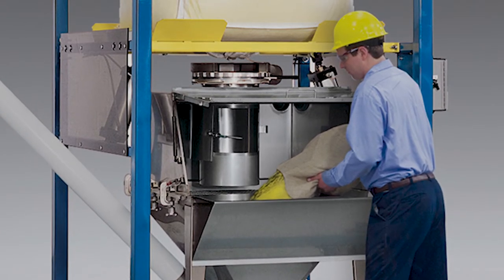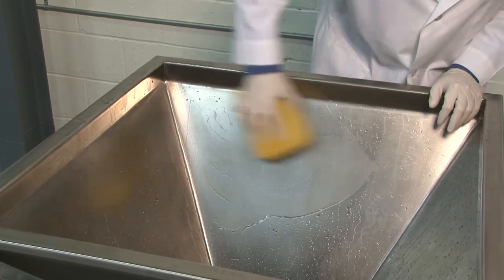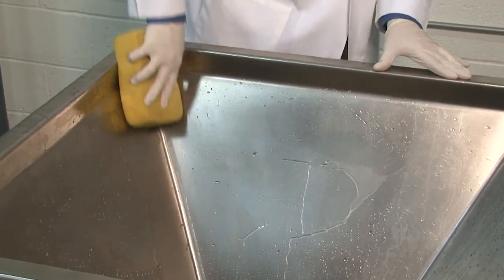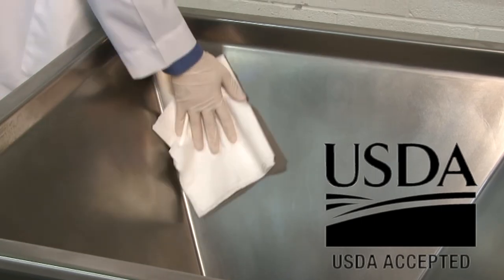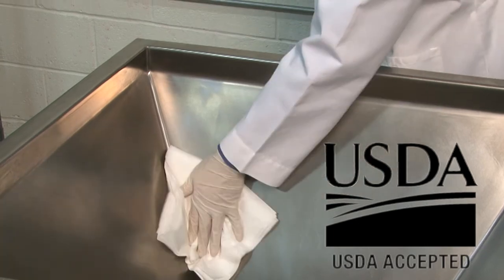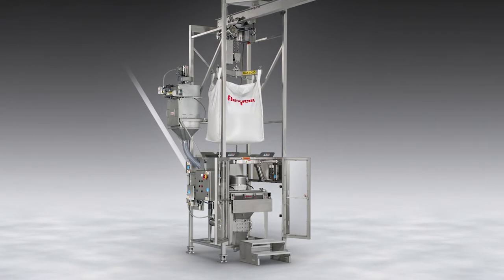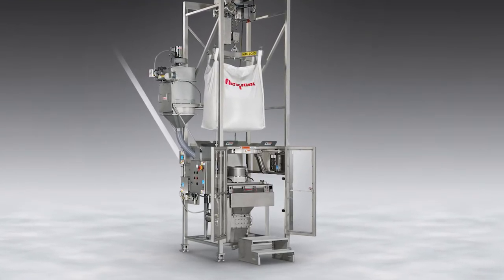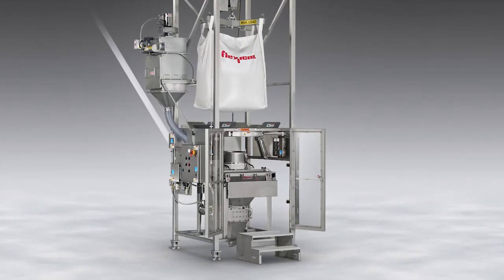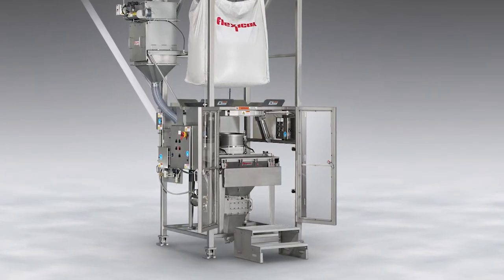A multi-purpose hood, which can also be vented to the bag-vac dust collector or an in-plant dust collection system, allows manual emptying from sacks, drums, and other containers in conjunction with discharging from bulk bags. All bulk-out dischargers are offered in sanitary designs with continuous welds polished up to mirror finish to comply with stringent food, dairy, and pharmaceutical standards of governmental and regulatory agencies worldwide. For example, this sanitary bulk-out unloader with integral sanitary flexible screw conveyor is constructed of 316 stainless steel with large radius internal welds, NEMA 4X wash-down control enclosures, and other components rated for wash-down using steam, cleansers, and high pressure water.